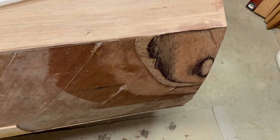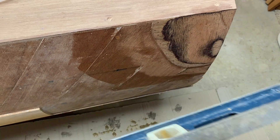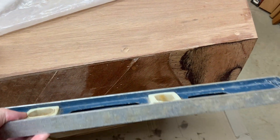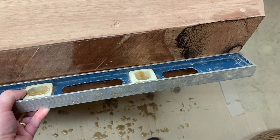In my last video I talked about having a couple of low spots, so I epoxied in a couple of patches of four millimeter ply, sanded that off, and then put CPS on it. Just to show how I knew they were low — I ran a straight edge and slid it up and down to see where the spot was low.